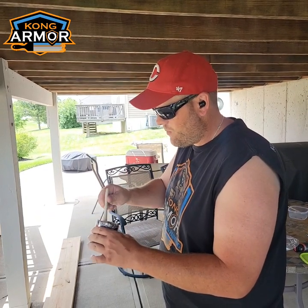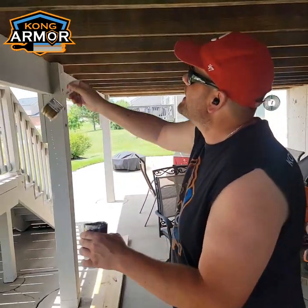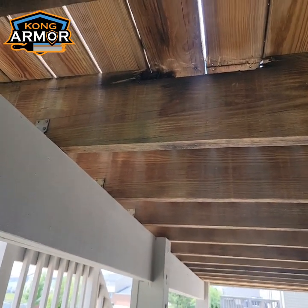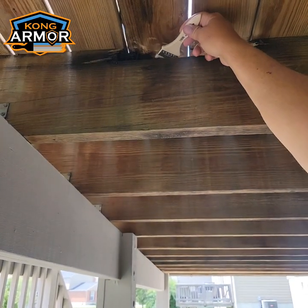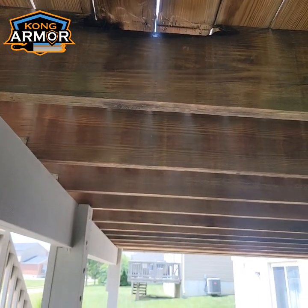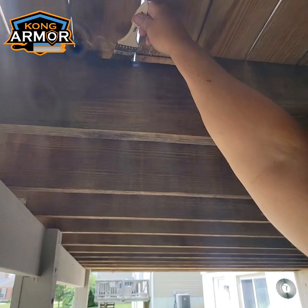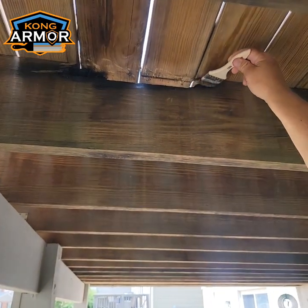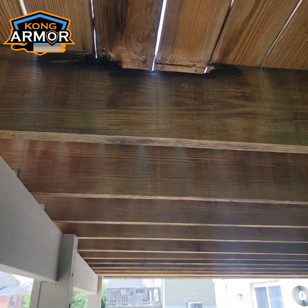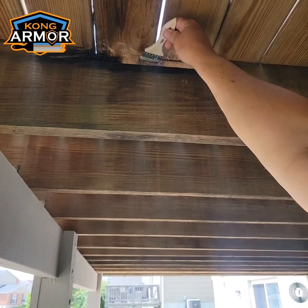What I've been doing for years now with joist rot is just dab it up there on that rot. It ain't gotta be perfect, but all we're trying to do is kill that rot and solidify it, make it rock hard so it doesn't continue going, right? Jeremy's getting ready to put sisters up here on these joists, and I want any of the bacteria, mildew, or mold to be gone. I don't want it jumping from joist to joist, so I want to eliminate it right here, right now. I want to kill it.